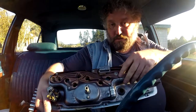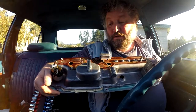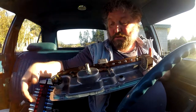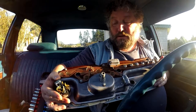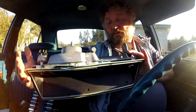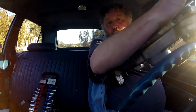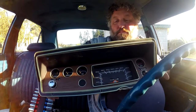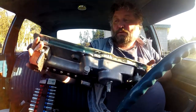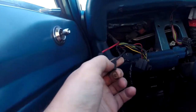Anyway, things look pretty good back here. The circuit board - all the traces are still good. Sometimes you see those lifted up and they don't make good connections. A whole bunch of the lamps fell out, but this is the opportunity to replace all the lights. There's a wobbly mount here I've got to figure out a better way to secure, but actually it's a pretty good unit. I'll clean that up, put all new lamps in, and we'll see what's up with that.